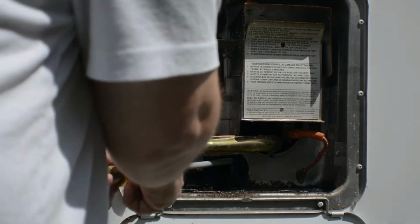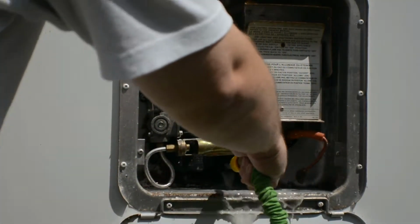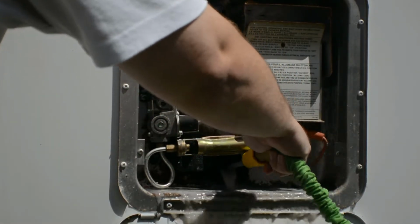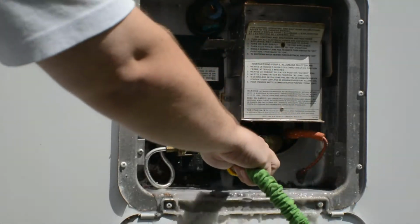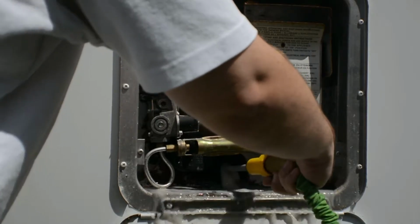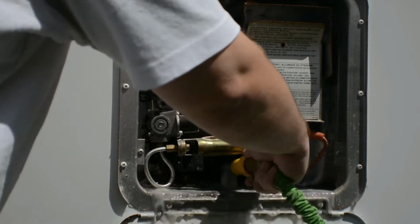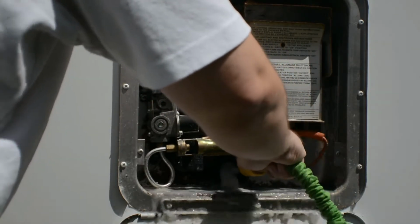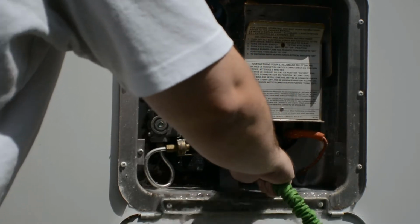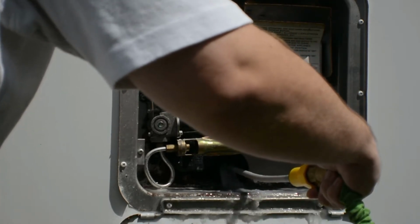The best method that I found with this is to take the rod itself and place it back as far as you can to begin with in the hot water heater. That way it gets a lot of that sediment coming forward. If you notice the water here, how muddy and murky it is, it was really, really corroded inside. So I did multiple runs of cleaning this out. You don't have to do that. That was just my own preference. I'd like to go ahead and get the job done once and just continue to do it over and over until it actually got clean.